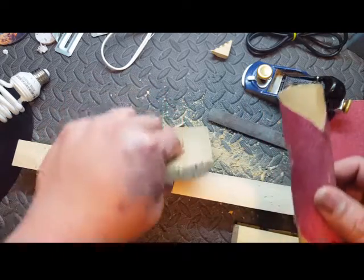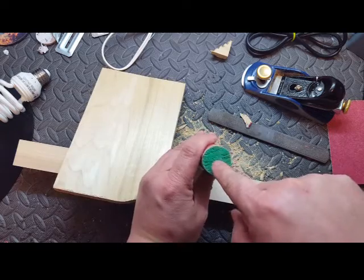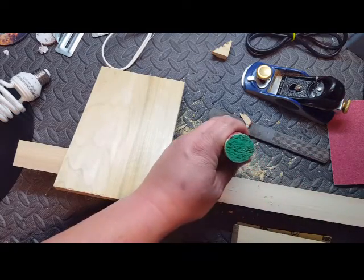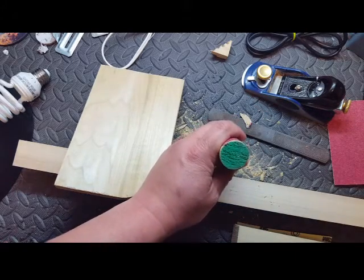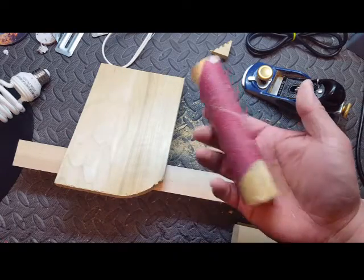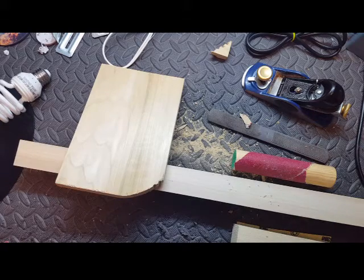What I also did — I had another piece but I threw it away a long time ago — is I drilled a hole right down the center of this, tried to get the exact center, drilled the hole, then drilled a quarter inch bolt in the middle of it, tightened it down, and then attached it to the drill. I would only do that for 60 grit or so, just to get most of the meat off, but then do it by hand when you start going to finer and finer grits so you've got more control.